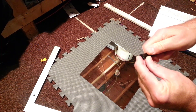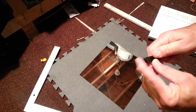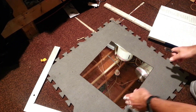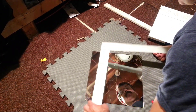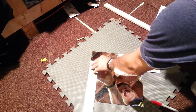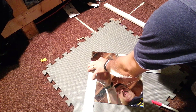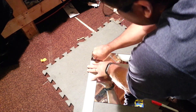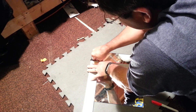We don't actually cut the glass, we score it. So when we pull across, we should get a zipping sound if we're doing this correctly. I'm lining it up, making sure that my center line is going to match, and then I want a nice zipping sound.